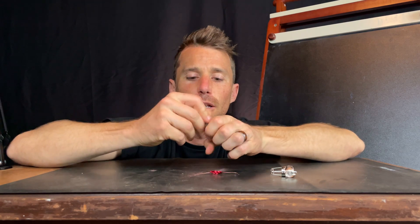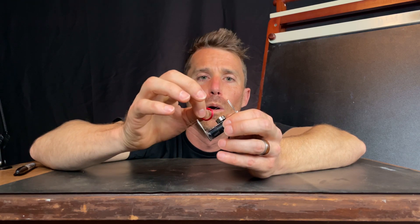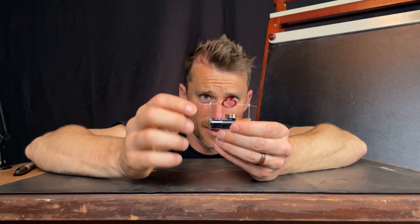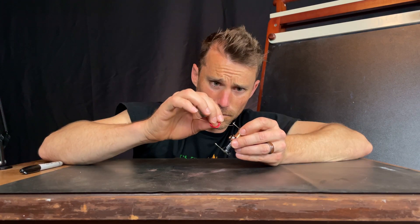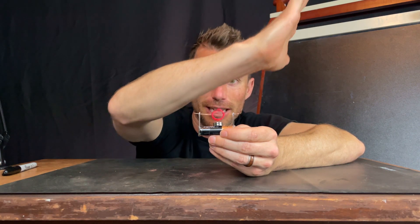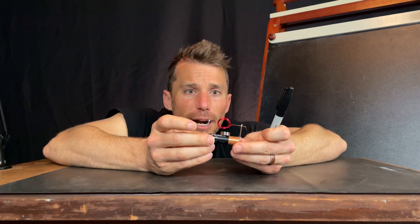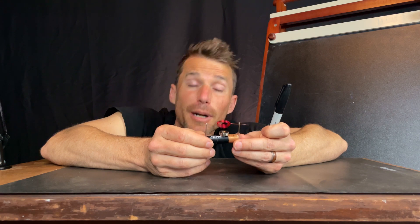Let's do this. I'm just going to take my Sharpie and draw on one side. I've never actually done this, but I learned about it this year from a friend I work with. All we did was put a little Sharpie on half of the copper. It's going — it's kind of working, it's wanting to. Let me put a little more Sharpie on. That's crazy — just putting Sharpie on one side makes it so the contact turns off. As it's going, it feels the force, then turns off when it gets to the Sharpie, then turns back on when it gets to the copper. A neat little trick — allows you to sand both sides and your motor still works. I think it works a little better when you sand half versus Sharpie half, but it is working and that's interesting.